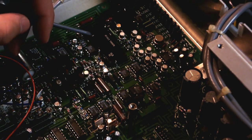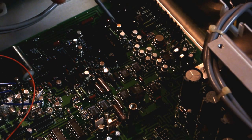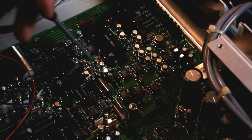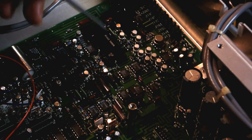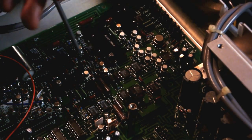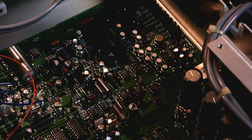This, I think it's a hybrid. It's got quite a lot of pins on the bottom. You obviously can't see that, but it's labeled RF9413THD676. I suspect this is a custom hybrid that's doing some of the multi-slope ADC. Not sure exactly what they would cram on there, other than maybe some high-speed digital or something to do the timing. I don't see any clocks nearby or anything like that, so I'm not totally sure how they're going to be measuring with this. So I might look in the service manual and see if I can find out more about the architecture and just maybe annotate or something.